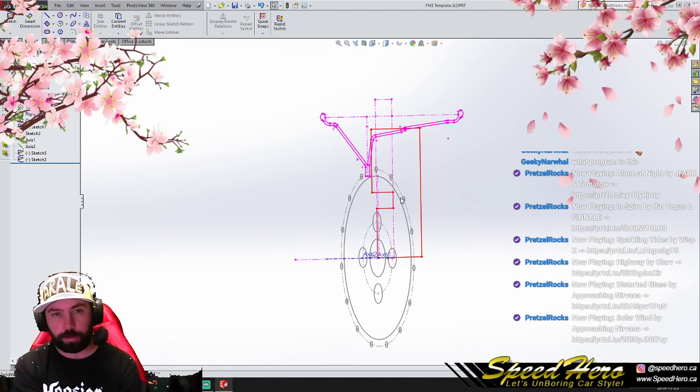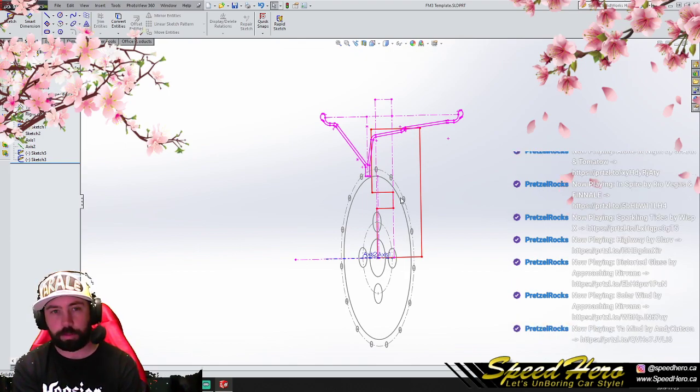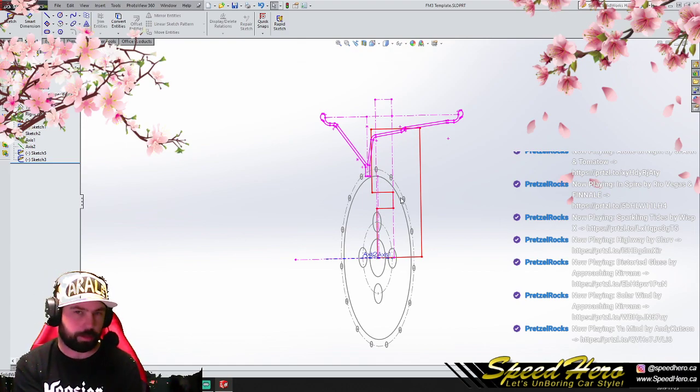The original Mazda Speed wheels are 17s, and so to fit a 15 over here is aggressive. It's possible, and the car that we took the measurements from did have 15s on it, so it is possible. But this particular lip design that I've been given from our lip supplier won't work. And so this is a really important part of this design process. We could do our 5, 5, and 5, which are still the goal here, but it would be kind of a waste of time if we're going to have to run a larger face design.